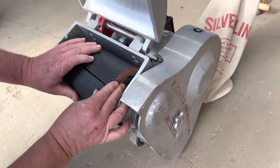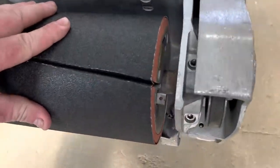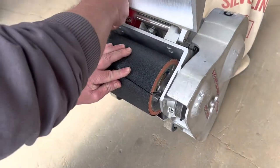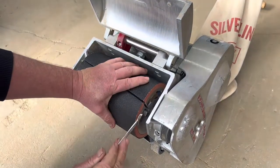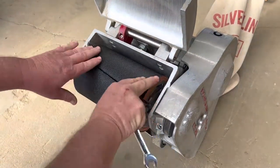Make sure it's as square as possible and pull it in tight with your hands. Then take a 12mm spanner, close the cam locks up slightly until they go a bit tighter. Once the left hand side one goes hard, nip up the right hand side one a little bit more, and that should be it. Thank you.